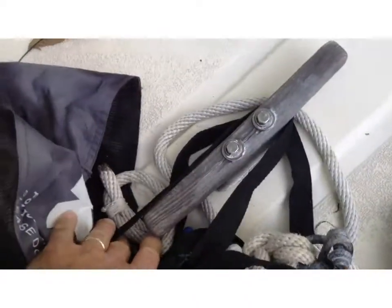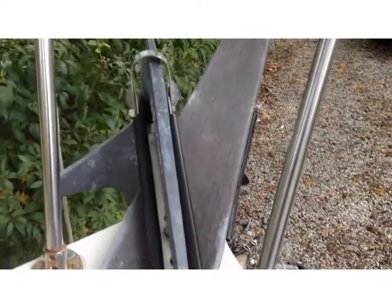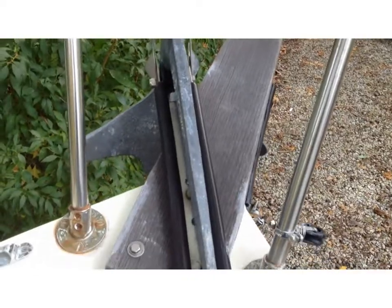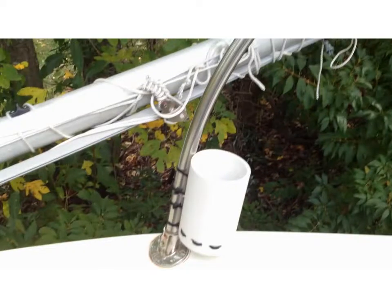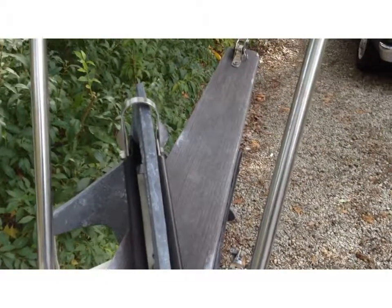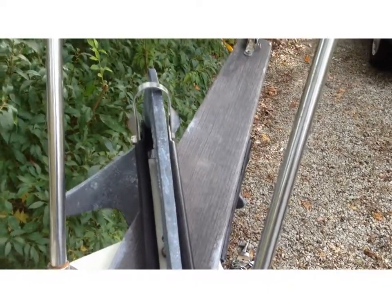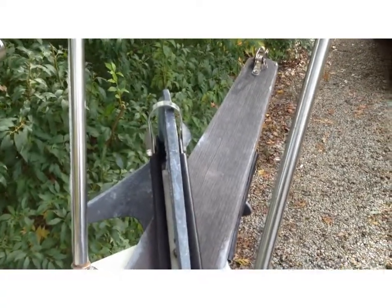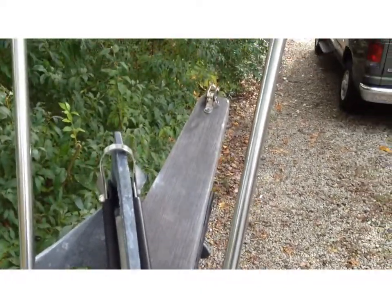It originally came with this big teak cleat, and then when I added the bow roller, I think our third season, that now holds a 16-pound Bruce anchor, which I love. It holds the boat through all kinds of stuff. I've been very happy with it. It serves us here in New Jersey, in sand and grass. It sets. I've spun around at night, and this anchor's never dragged. We did drag one time during the day with a wind shift with the 9-pound Danforth I have.